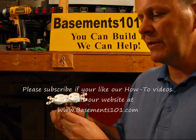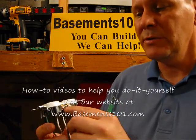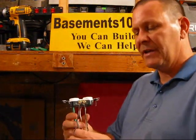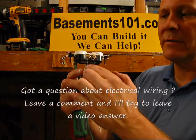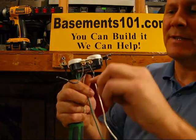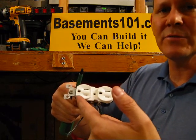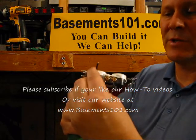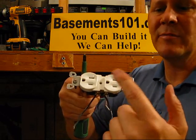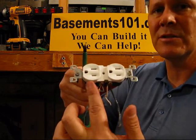So with that said, if you're having problems with one side of the outlet or the other in your house, or if you've just wired an outlet and only one side works, what you want to do is check and see if this tab is still in place. If that little tab is gone then the power is not going across. Also keep in mind: this hot wire coming into the outlet — if the breakaway tab is gone, this line could come from a switch and this other line could be hot all the time. So if this side works all the time and this side does not, check for a switch for this side. If the switch is on you're going to have power on this side. If you have no power on one side, check to see if the breakaway tab is broken off and then look for a switch that controls that side of the circuit.